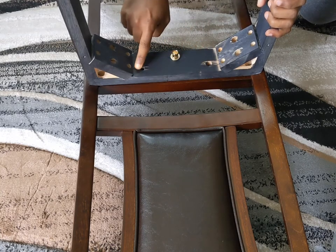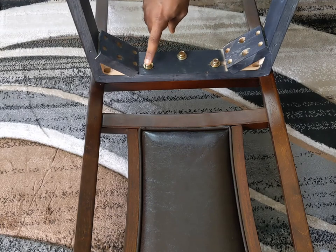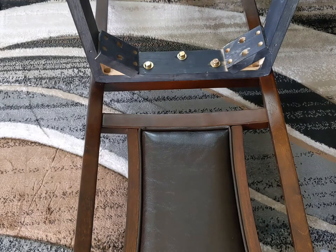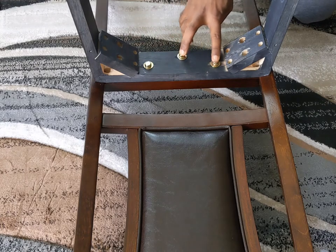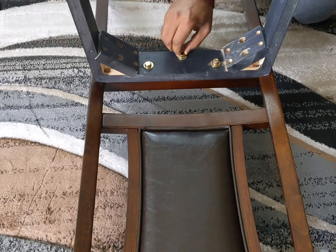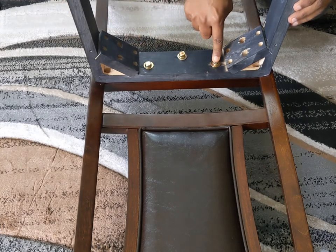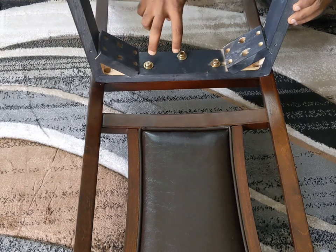I have now attached all three bolts. One tip when doing this kind of work: if you have to put multiple bolts at the same time, try to first place them all together and then tighten them. Because if you tighten one fully first, you'll have to loosen it again to align the other two. So place all of them first, then tighten them together.